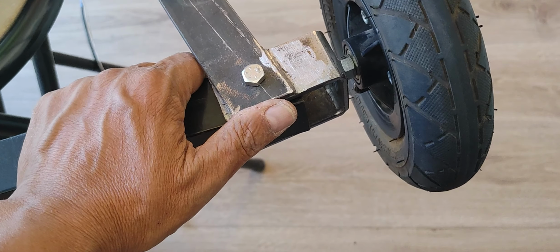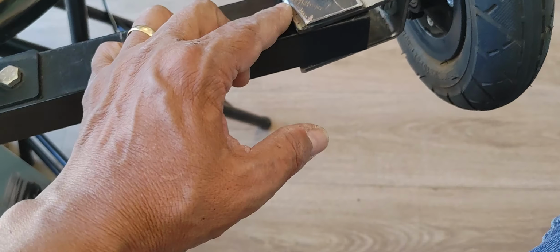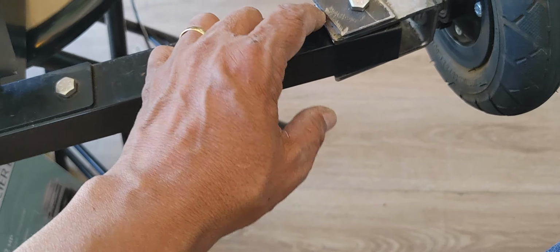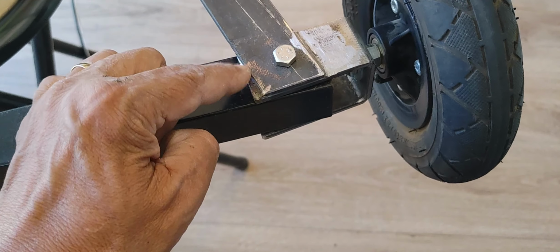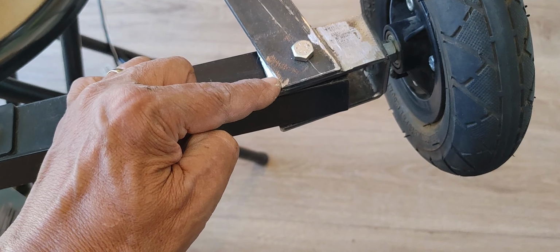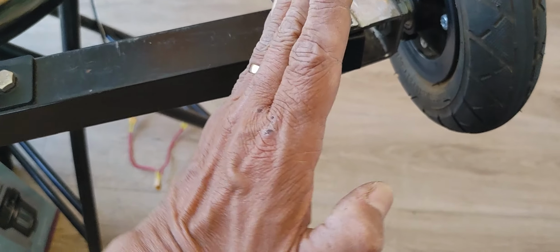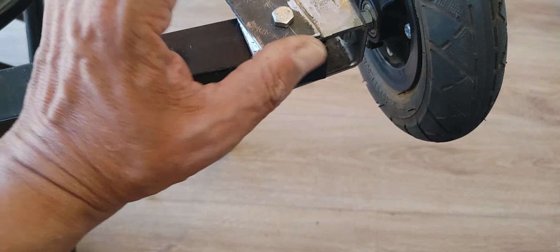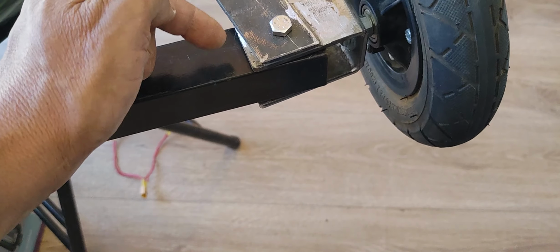And you've got to have a welder, something that is going to allow you to weld these things. This is just wire. I guess that's MIG welding. I don't use gas. I don't use anything. I just feed directly from the wire, and I just take my time. It's something you have to learn, not to go too fast, and I do it in little circles like that where these things mate at 90 degrees. So I kind of go at 45 degrees, and I just take my time.